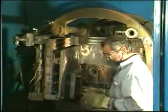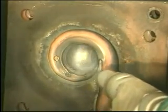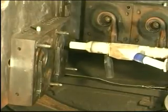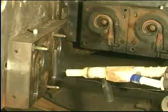A similar application is the cleaning of hot boxes or core boxes used to mold sand with thermosetting resin for making sand casting cores. Again, the cleaning can be carried out on the machine while the core box is still hot, with a minimum loss in productivity.